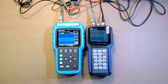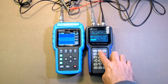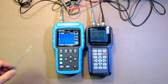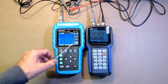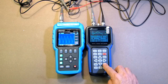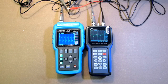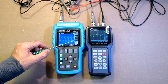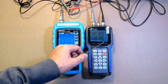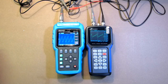Now let's check other waveforms. Signal generator. Let's choose 1 MHz. Waveform. Okay, let it be. It's okay. In this case, the voltage is 276. Here we have 256. Frequency is 999. Here we have 1 MHz. Signal generator, waveform. Hope it will be the same. So the waveform is not so ugly for such a frequency. Voltage is 236. Here we have 264. Now the frequency is 1 MHz, sometimes 996, sometimes 1.002. Here we have 999. Which is okay.